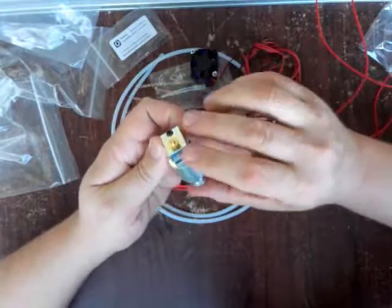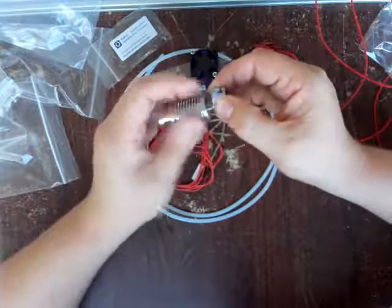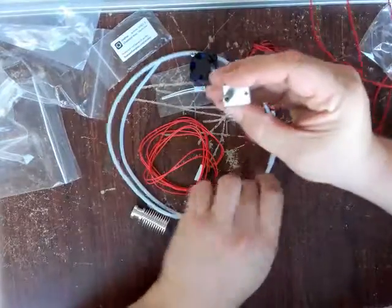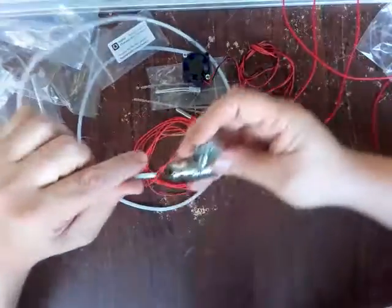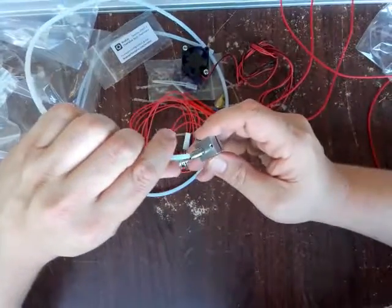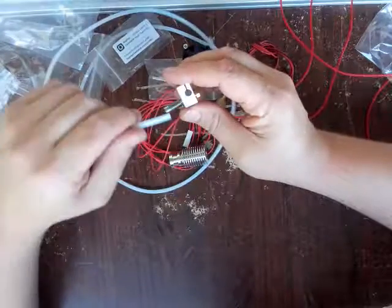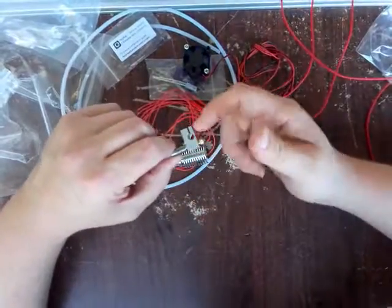One thing I didn't look at — I have a 0.4 nozzle. It looks like it needs to be tightened up a bit. I can also take a look inside of here. You can see the extent to which the PTFE tube actually goes in — about right there. It's gonna run all the way through and go down, bottoming out about right here. So basically from the threads down, you have all that safe space to protect the PTFE from the high temperatures of the all-metal hot end.